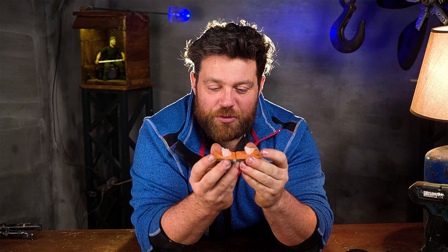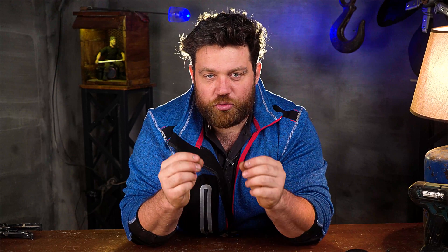The result of this experiment is so interesting. We can clearly see that the silicone underwater dries up quicker, but so quickly that it forms like a shell all around the outside. This very dry silicone on the outside doesn't allow the water to cure the core of the silicone itself. So the core is always wet and the outside is completely dry — and that's terrible. The solution could be to mix silicone with water in a glass jar, but this isn't a great idea because it changes the structure of the silicone and creates steam bubbles inside. It doesn't work at all.